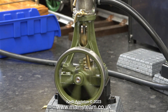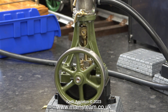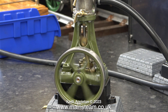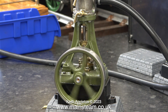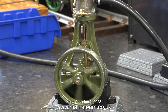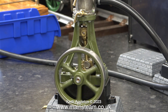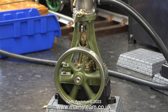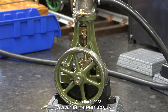The thing that really bothers me about this engine is the flywheel. At first I thought the crankshaft was bent, but I'll show later in this video that it definitely isn't — it's the flywheel. Whoever machined this did it carelessly and actually wrong. The way I machine flywheels is to set the flywheel up held by the external part in a four-jaw chuck. I'm only really interested in the early stages that the inside edge of the flywheel — the parts between the spokes — runs as concentrically as possible. When the flywheel is running perfectly true, I machine the centre boss on one side only.